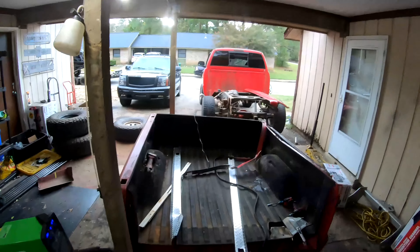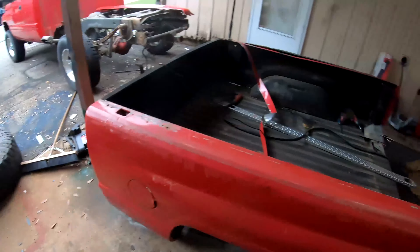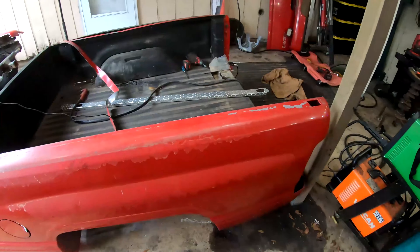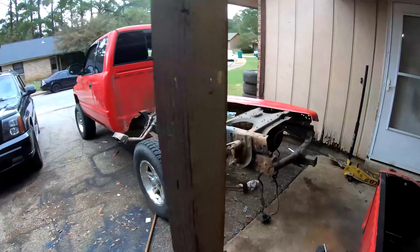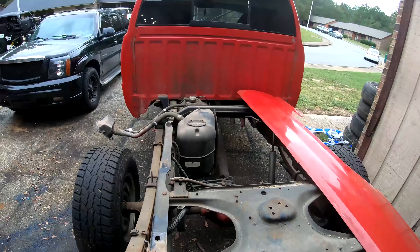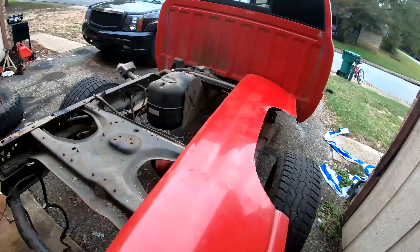As you can see, bed's off the truck. Figured that was the best way to do it. All I'm actually gonna do is take these outer skins off the very outside of the bed. I'm using the tailgate for a bench, and I'm gonna use part of the bumper as part of a bumper because it's already shaped — don't have to redo the shaping. But these skins are gonna get tied into the bed via tube work. I'm building tube support and leaving the bed middle section open, trying to save as much weight as possible. It's already a really heavy truck, so just using the skins and some simple tube work with no fenders should work well.